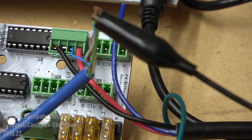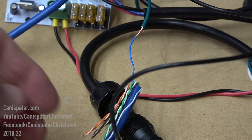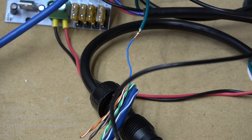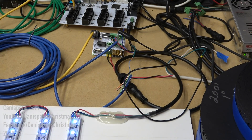The rest of the wires I have tied together on this side as a negative off the same power supply. Just the skinny little blue wire for data, with the rest of the wires serving as a kind of shield. On the other end, I have the blue wire connected to data feeding the pigtail. The only change I made is adding 10 meters - about 34 feet - of Ethernet cable in between the data line. The signal is good, which means it can travel through 35 feet with no F-amps or anything - coming straight out of the controller.